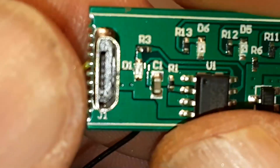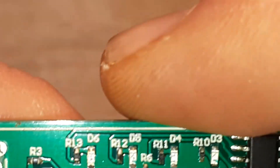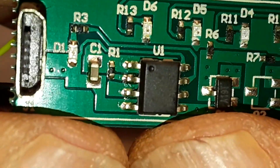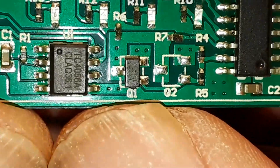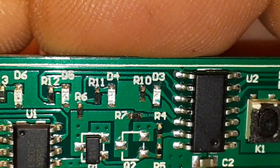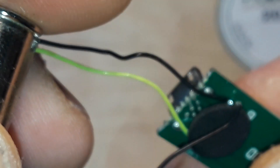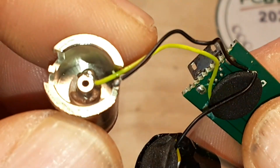As we examine the circuit board, we've got power coming in going through a diode, resistor, capacitor, resistor, capacitor. There's an LED, and then we have this chip which I'm just going to guess is some sort of charge control chip. We have one transistor here Q1; Q2 is not populated. Then we have our voltage LEDs up top — D6, D5, D4, D3 — and then we have this unmarked chip which will be our microprocessor, plus another LED down here. Here is the output, and it feeds into our heater.